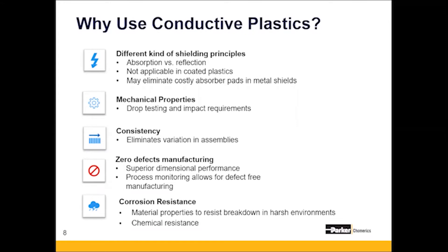There are also significant dimensional benefits to conductive plastics. The goal is always to get closer to a shoot-and-ship part — zero-defect manufacturing. You can achieve that through process monitoring by establishing the molding parameters, getting very consistent part-to-part results, and minimizing shot-to-shot variation. For example, on a 12-millimeter diameter or half-inch hole, you can get plastic parts to vary by less than 10 microns. This isn't utopia — it's just good upfront planning.